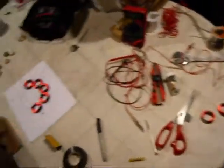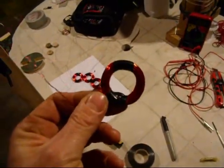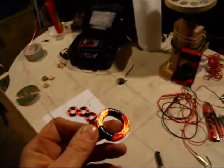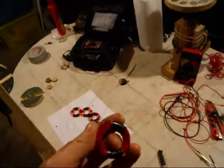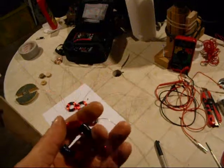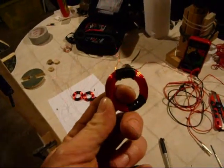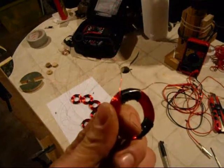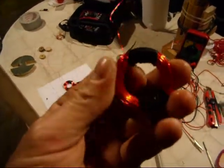I just wanted to say also that I did a test on the 200 turns — those are 250s — both the same gauge, 26 gauge. And the 200 turn did quite well also. It was running around 270 RPM, just a little bit more RPM, and I got it up to 3 volts.